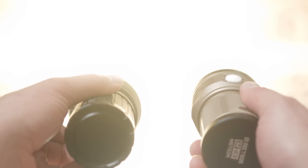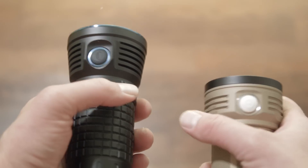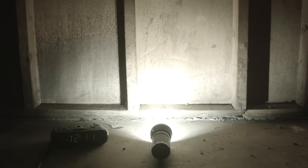How about those run times? I did all the modes except nightlight mode using 3500mAh high-drain batteries. First is turbo S — you get about 2.5 minutes of 9000-ish lumens, before it steps down to 2600 lumens and runs pretty steadily until 2 hours and 10 minutes, where it steps down briefly and cuts off at about 2 hours and 30 minutes.